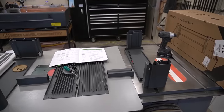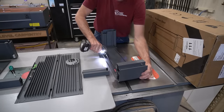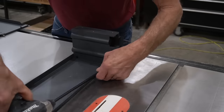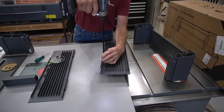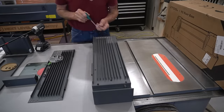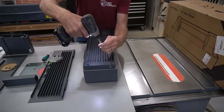First, I attach left corner pieces to the left side panel with 2 screws for each corner, starting them by hand to avoid cross-threading, and then tightening them lightly with an impact driver to lock them in place. Next, I attach the leg support block to the left panel with two screws, and then attach the left panel to the left structure assembly with six screws using the same starting and tightening steps as before. The right side structure is next.